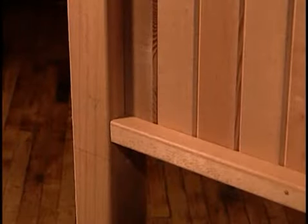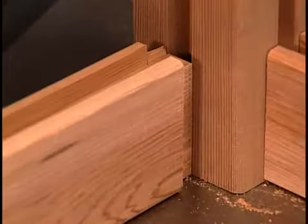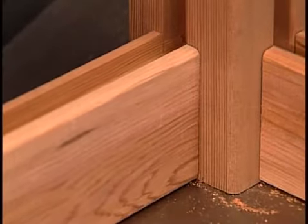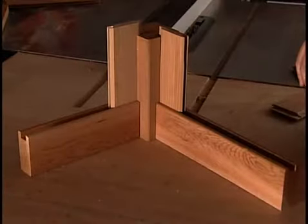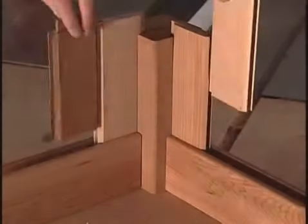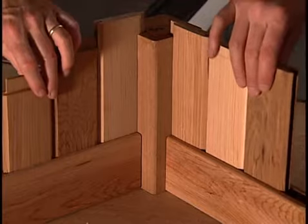The sides are made up from 8-foot lengths of tongue and groove board, cut down to 16-inch sections. Likewise, each rail, top and bottom, forming the sides, has a 5/8-inch dado cut into the rail to hold the tongue and groove panels. The 3/4-inch tongue and groove panels simply rest in the slots and are neither glued nor nailed. Let's look at some details.